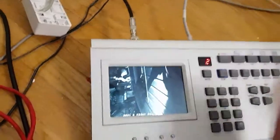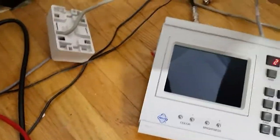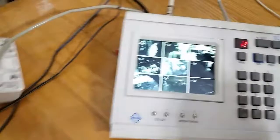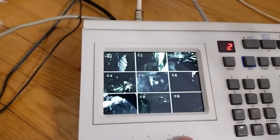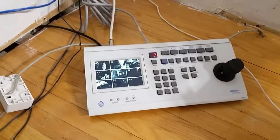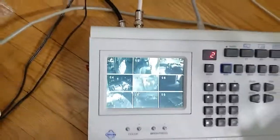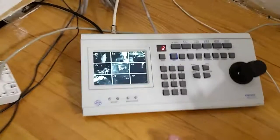That's really it - I'm amazed that this thing works. Really cool unit. You also have a stand on the back which gives you about 20 degrees upright. This is video out of the spot monitor of the DVR, so we get split screens and we can adjust the darkness and brightness. All cameras are snapped into black and white now so we won't see too much color, but there you go - KBD 300V, CM6800E matrix switcher, and we tied video directly into the monitor. It's just a little monitor with analog video input. No dark magic.